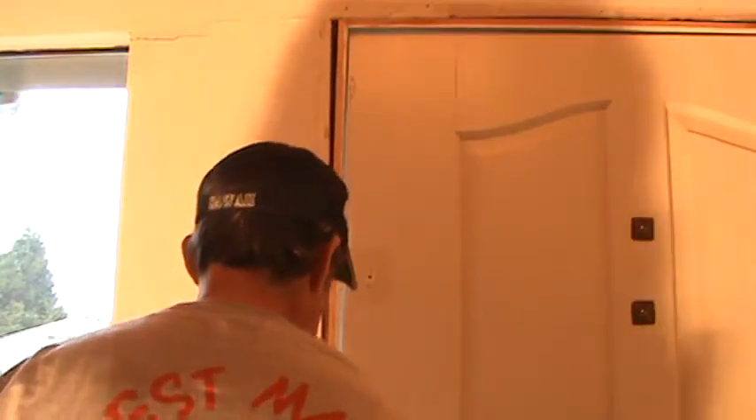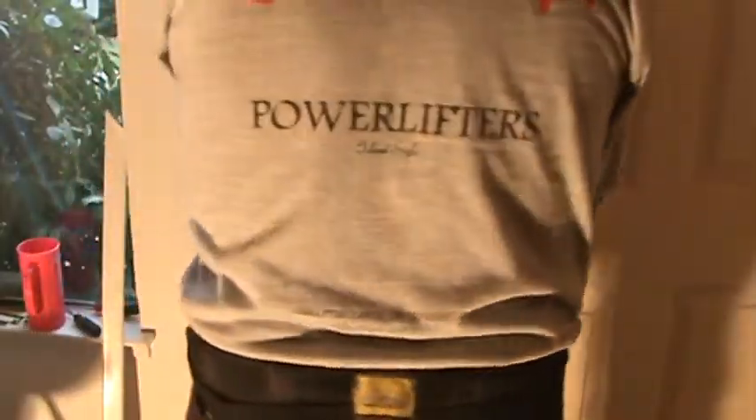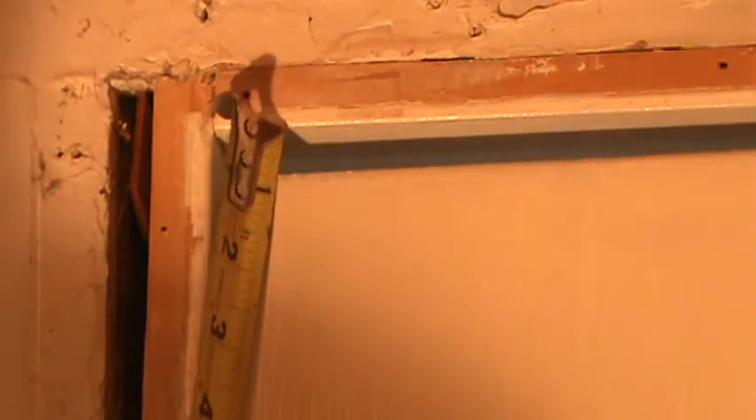My next step is unorthodox because I have to cut the door jamb — cut it off about a half an inch on this side. I've already got one cut in it, cut all the way across. Now I have to cut a half inch out of that because it's still way too high. When I close the door, I've got about a little over five-eighths of an inch up there, and I want a three-sixteenths gap because the right-hand side has about a three-sixteenths gap at the top.